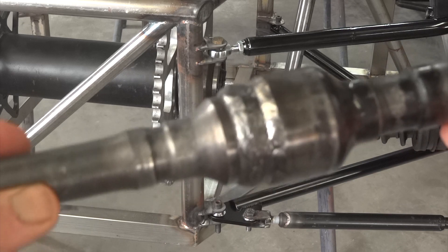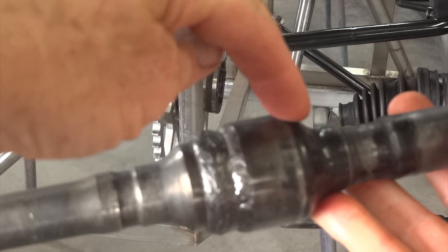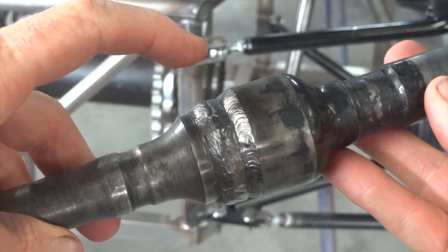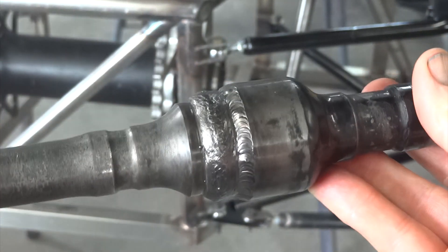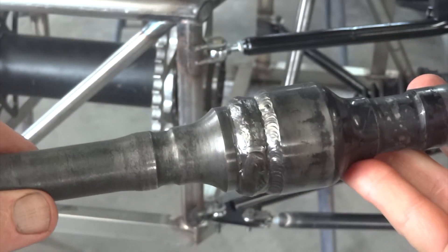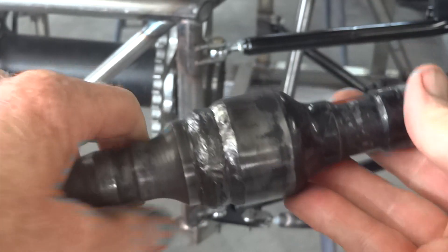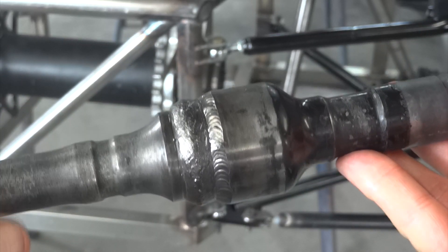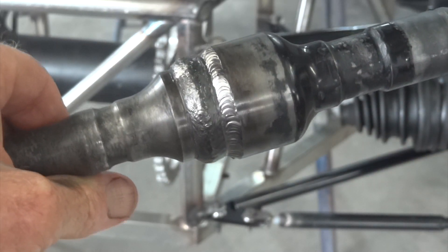For completeness, there's the finished little drive shaft. That's the N15 bit, that's the N12 bit. That big weld was made by the robot at the Nissan factory — that's my TIG weld. That's the biggest weld I was able to put in with a single run. It took all morning because I did a centimetre at a time, then left the thing on the bench to get back to room temperature, cooled the ends down in a bucket, and did another centimetre — about four hours altogether. Hope the weld's big enough for a little 300 kilo car with a 1000cc engine. I think it'll be alright.